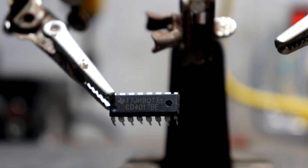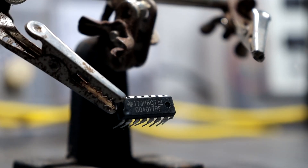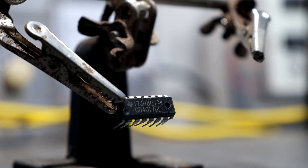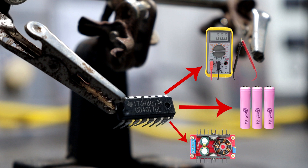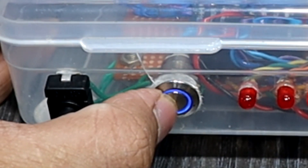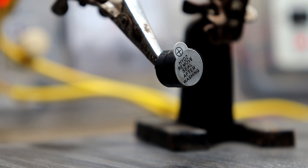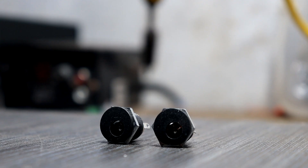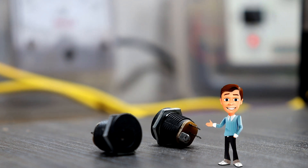In this project we will use the CD4017 IC for 3 different mode controls. The CD4017 IC is used for 3 different modes: continuity testing mode, direct battery output mode, and boost converter output mode. You switch between these 3 modes using a push button. We also use a buzzer for the continuity tester. We will use 2 female connectors — the first one is for the charging port and the second one is for the power supply output port.